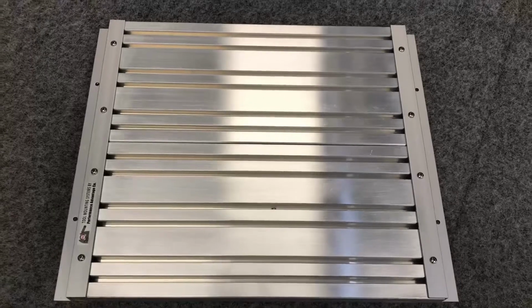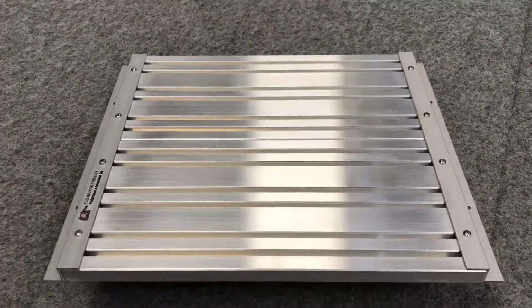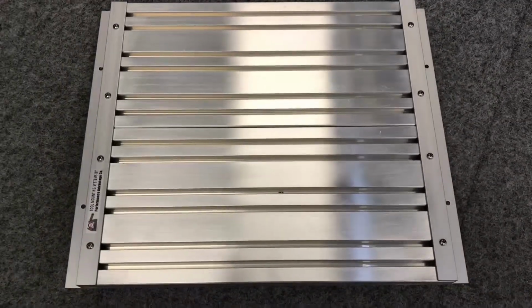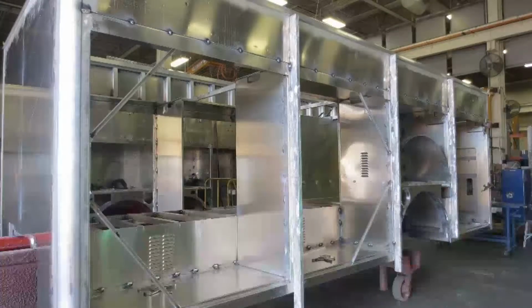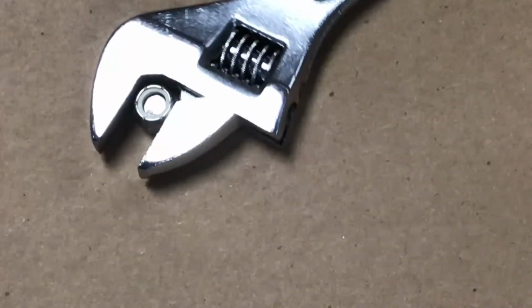Your standard wall-mounted tool panel will arrive fully assembled with Z-mount channels on each end that are pre-drilled with 1/4-inch holes for mounting. If your tool panel was part of the original specs for building and equipping your vehicle, the equipment manufacturer would have had access to the backside of your compartment walls during fabrication and would have been able to use nut and bolt construction for these panels during installation.